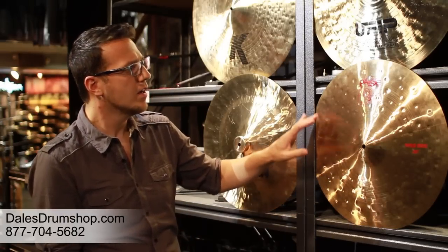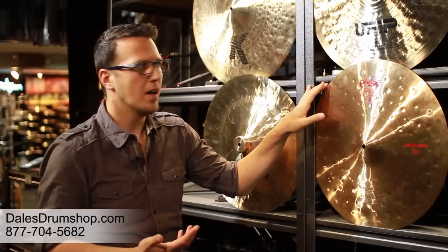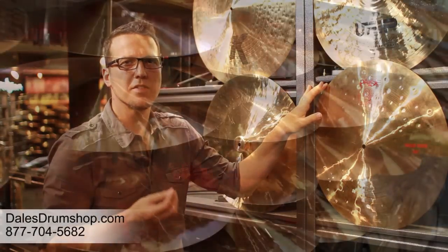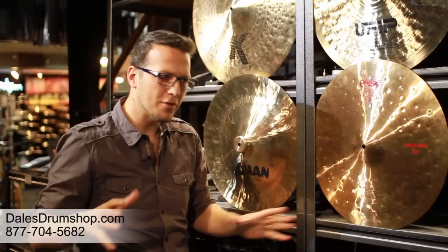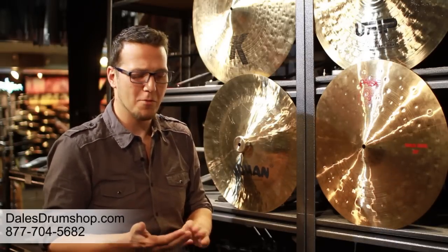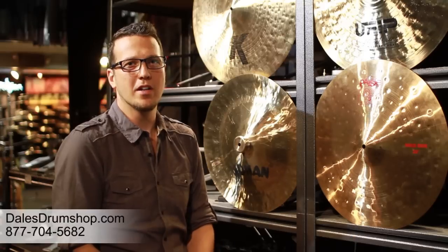The second method I'm going to call the Swiss method, because the Swiss were the ones who made it most famous, although it didn't originate there. I'm talking about the sheet cymbal. The Paiste 2002, a very famous cymbal, has a very distinctive sound because it's not made in the Turkish method. The inconsistency of rolling something out differently every time doesn't fit Swiss culture — they like consistency and predictability. If you break a sheet cymbal, you can confidently buy another one and expect it to be exactly the same. They're the most consistent of all.